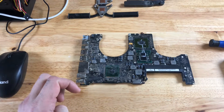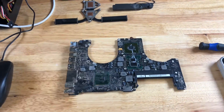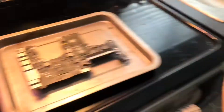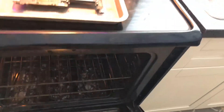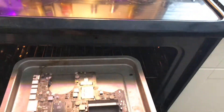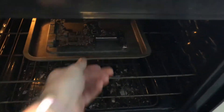Then I'll take it back down here, put some new thermal paste on it, reassemble it, and we will try Cinebench again. Sorry about the dishwasher noise — I didn't think that went through timing-wise. But the oven's at 425 degrees. I'm just going to go ahead and pop this thing in there very carefully on four very small tinfoil blocks that you'll have to shape and make for it. Now we count down seven minutes.